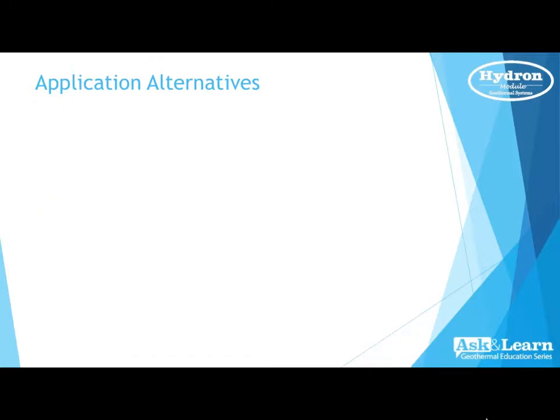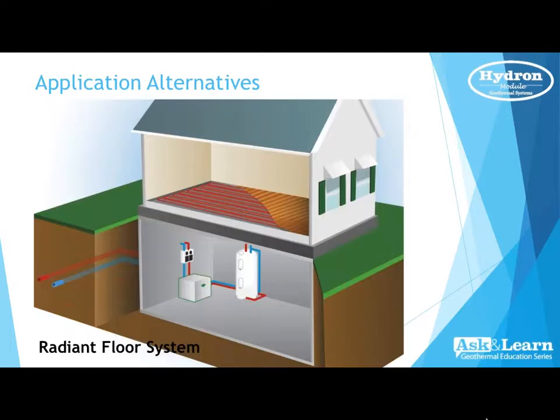But the nice part about any forced air system is that we can do mechanical zoning, to where we can have the master bedroom or the bedrooms isolated from the upstairs and the downstairs. So you could have 3, 5 zones, however many you would like, that make your house comfortable.